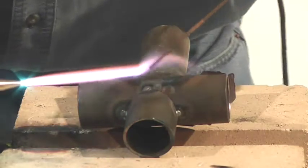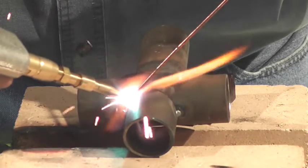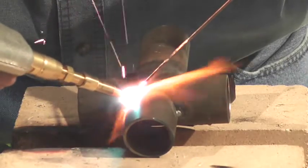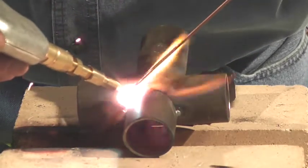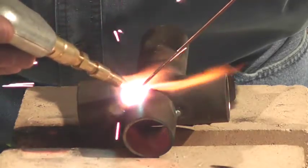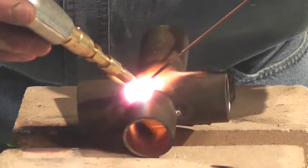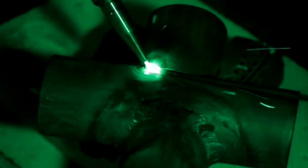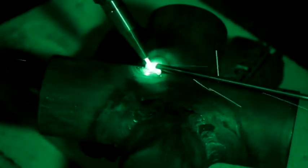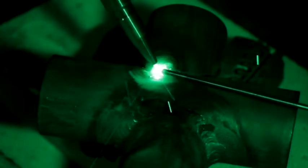We've already got it tacked up — you'd go in and tack it up real well. Just going to show you a small weld: take that cone down, get it where it's molten. On chrome moly tubing I have a tendency to do a little more of a circular motion, because you want to make sure you get both pieces tied together. You can see how nicely it controls that flame — soft and concentrated, you have absolute total control.